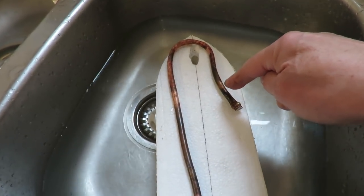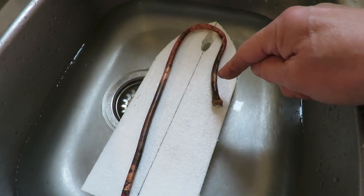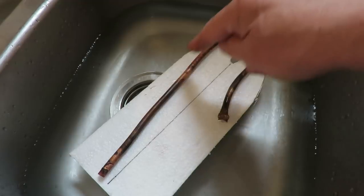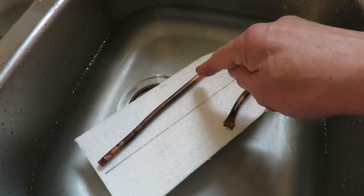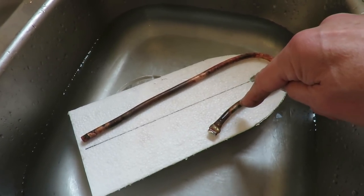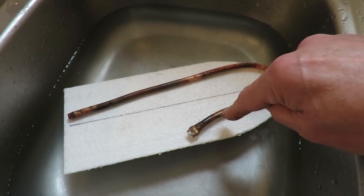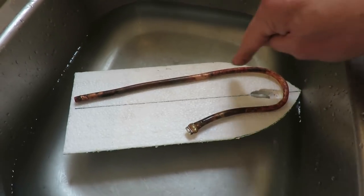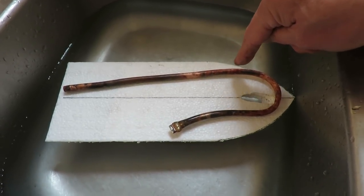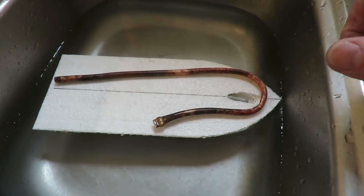So we're going to heat this end with some water in it, and it should work the same way as an ordinary pop pop boiler. It'll heat up, boil up the water that's in there, push it down the pipe. When it gets down here, it'll get cold, it'll condense again and go back up again. Did I say water? I meant steam, didn't I? Boils the water, it turns to steam. That expands, increases the pressure, pushes the water down the pipe. But as soon as the steam goes far enough to get cold again, it condenses and contracts, creating a partial vacuum. So the water gets pushed back up the pipe.